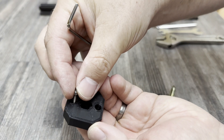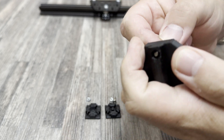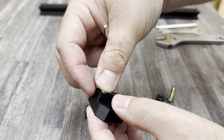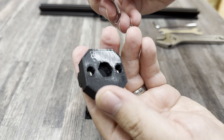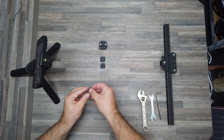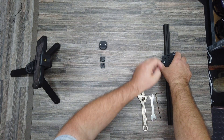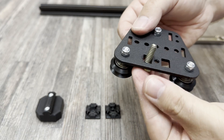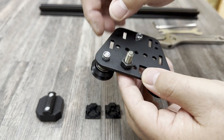You might be asking: what are these bolts for? The bolts help prevent the top part from breaking off under weight and strain. Next, we will attach the quarter-inch UNC bolt to our runner, and this will be used as a post to attach our camera equipment. This admittedly looks a little janky, but it does work.